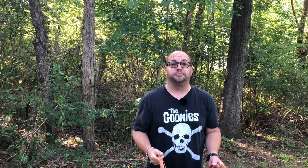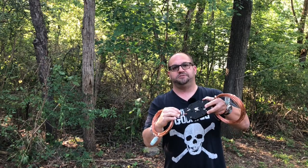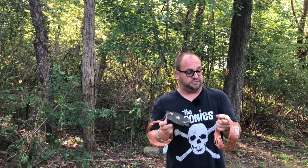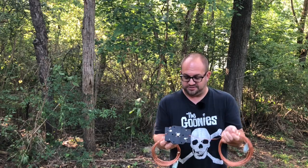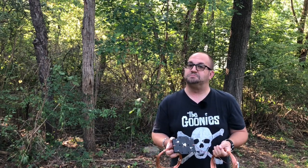So today I'm going to be putting up a new antenna. On Friday, a ginormous storm came through my neighborhood and knocked down a few trees in my yard and with it, knocked down the fan dipole that I have since put back up. But it's just not tuned so well anymore. And rather than reconfiguring everything, I decided to put up this, which MFJ sent me a few months ago after Hamvention. This is the MFJ 2012 off-center fed dipole — for 40, 20, 10 meters, and 6 meters, rated for 1,500 watts. I'm only running 100, so we're going to put this up and check out the SWR and see if we can hear anybody. I'm not one to say that the bands are dead, but they sure haven't been great lately. Stay tuned.